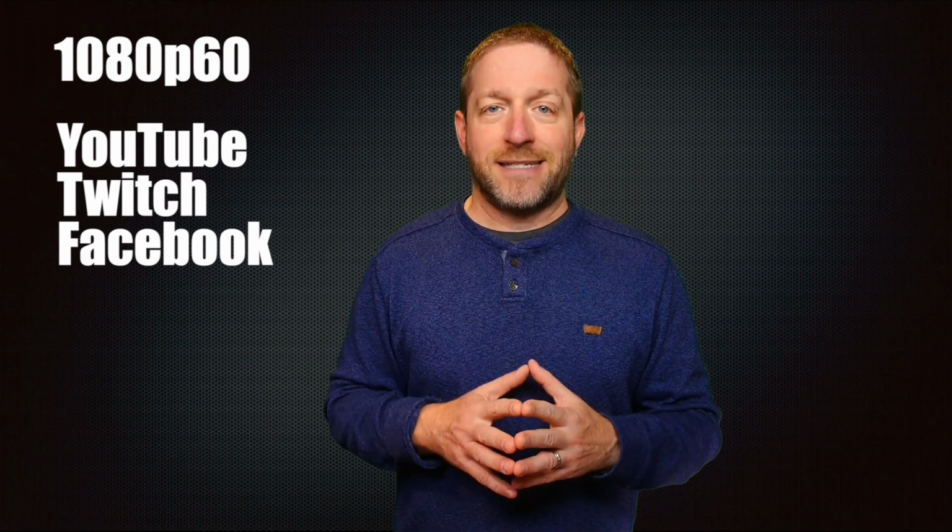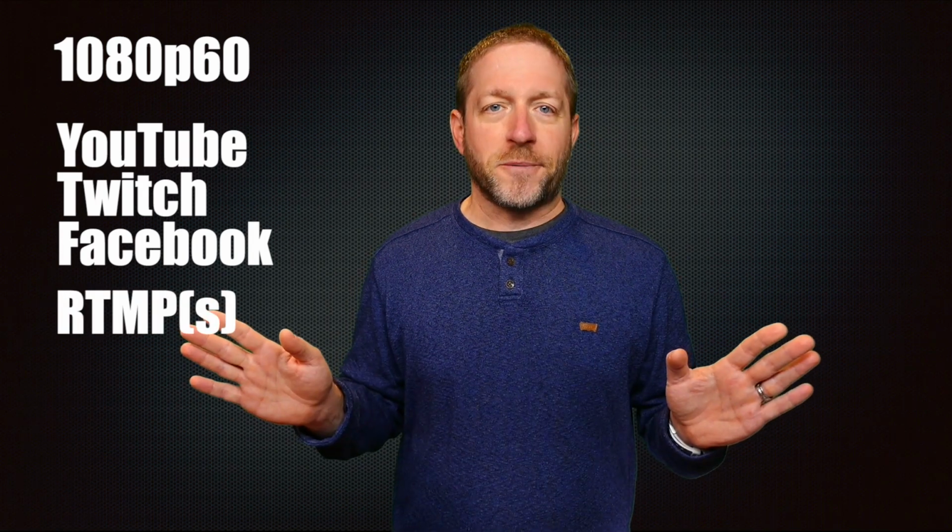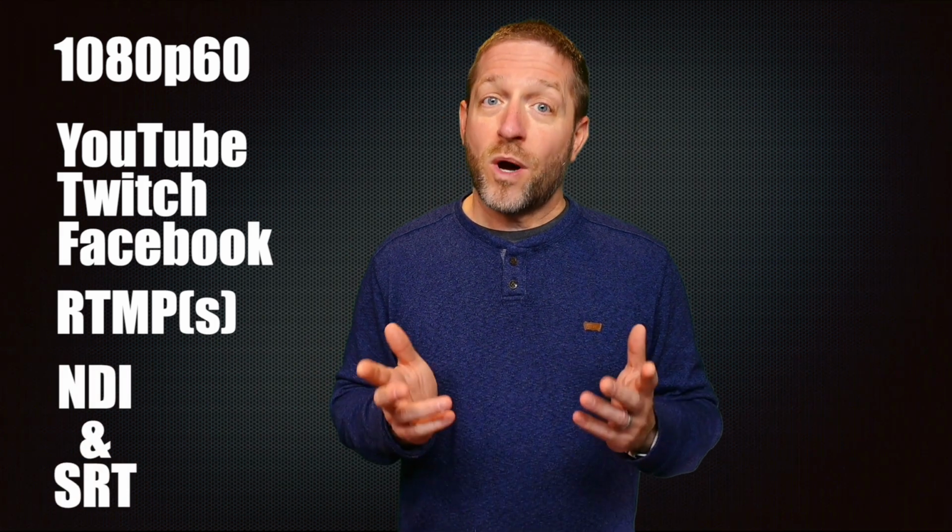It has built-in APIs for YouTube, Twitch, and Facebook, as well as standard RTMP to wherever you want to go. It will also send NDI output and SRT output. But what about recording? Well, I mentioned the SD card and internal storage already. It can also record to a USB drive if you need to hand off the footage pretty fast. There's also 2-channel ISO recording. You get to select from the program output, HDMI inputs, or USB inputs. There's a lot going on with the Magewell Director Mini, and I am excited to show it to you, so let's dig in.